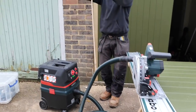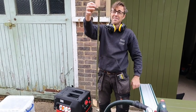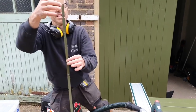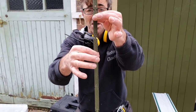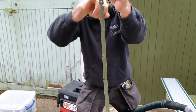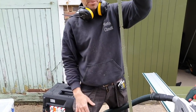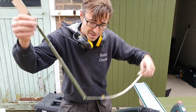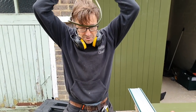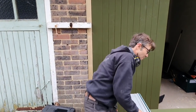Look at this section through the tongue and groove - it's amazing how it's held itself together, I think that's all by paint. You've just got a rebate there, so that must be mechanically fixed, then you've got these nice little tongue and grooves. You can see how much tolerance is allowed in that tongue - it's all about expansion and contraction. Right, that's done - let's do the next one.